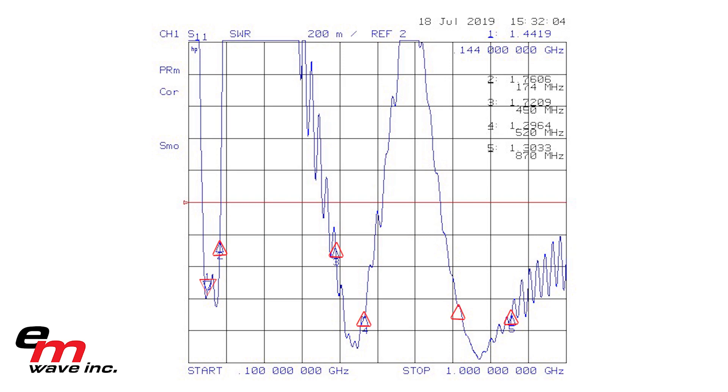The system performance for both VHF and UHF bands are operating below a 1.8:1 VSWR match, while the 746-870 MHz band portion performs with exceptional matching — less than 1.5:1. The results of our installation verify 92% or greater signal transmission for both VHF and UHF bands, and better than 96% signal transmission for the 746-870 MHz band.